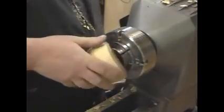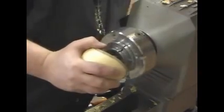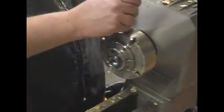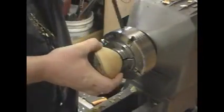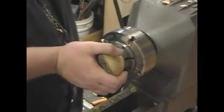I'm going to put my spindle lock on, grab this and give it a yank — came off pretty easy. Undo the spindle lock and then I just turn it with a hand wheel. Hand wheels on the lathe are quite useful I think. Now I'm going to undo this, take the worm screw out, take my bowl blank and put it in there like that.